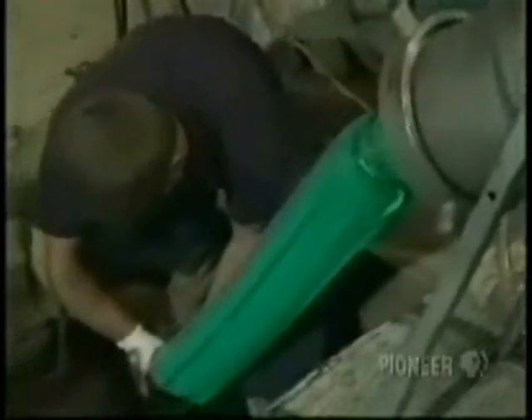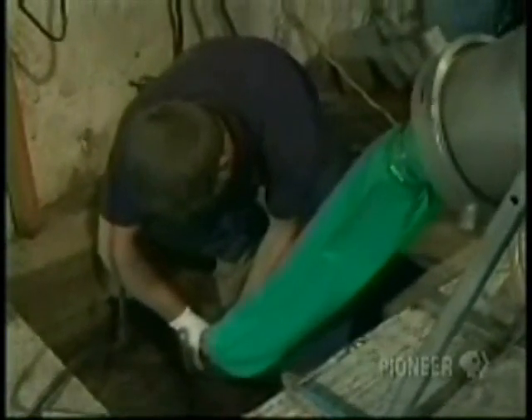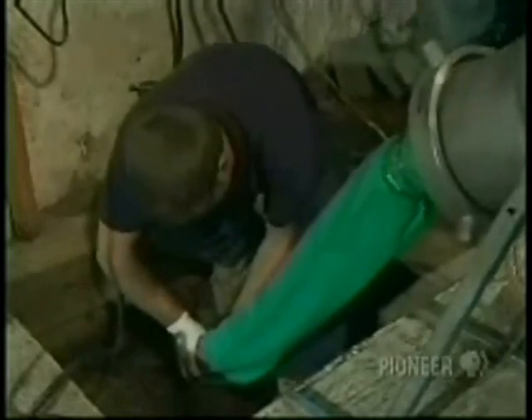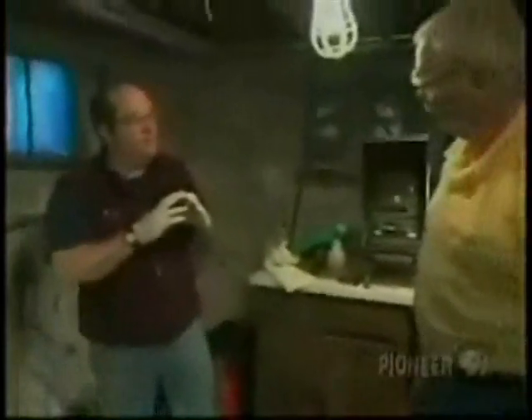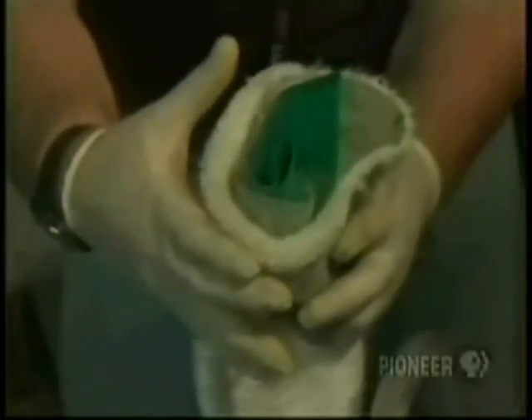So that elastic is going all the way out to where the sewer is. That's correct — and it's out. So it just popped in the line. Now we've got that whole liner in there but it's not in the shape of a pipe — how do we do that? We're going to form it with a bladder. So what you've got is a liner laying inside the pipe and now you put this bladder down inside and fill that with air, which will make the liner take on the shape of the pipe. That's correct.